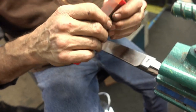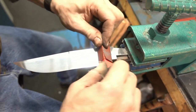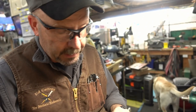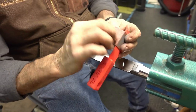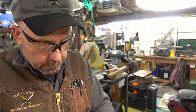The other trick with these sticks is when you come to your ricasso, treat your ricasso like a totally separate part of your knife. Sand flat on the ricasso — don't fall off of it. You sand that — it's just another part of the knife — and it comes out clean. Then you can go back and sand on your blade. As things get dull, tear it off and go to a new piece. You'll get a lot more mileage out of your sandpaper this way than trying to wrap it around a file or something like that. A ton less waste — a lot more conservation of your abrasive papers.